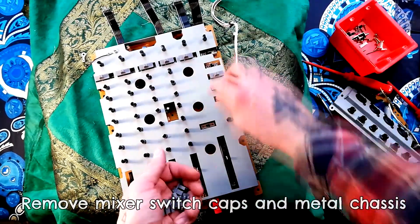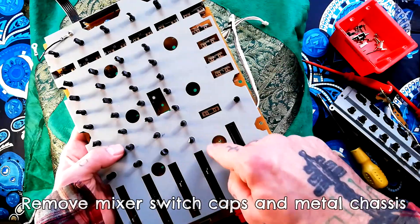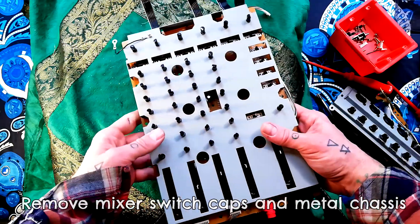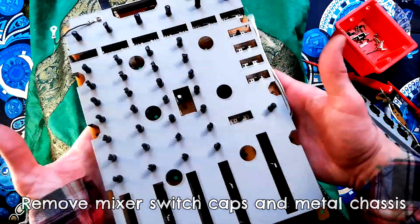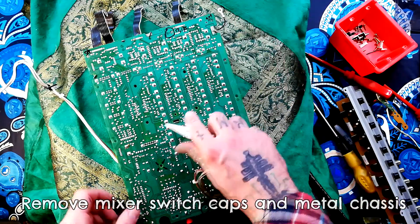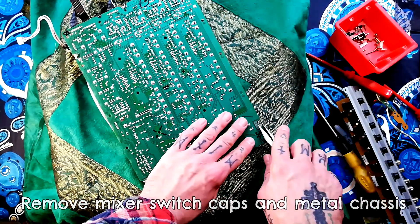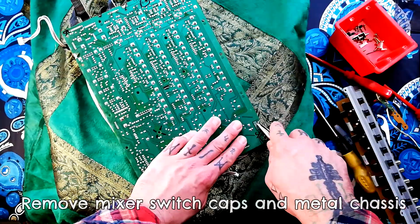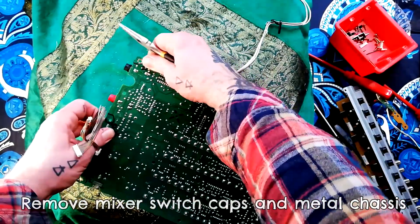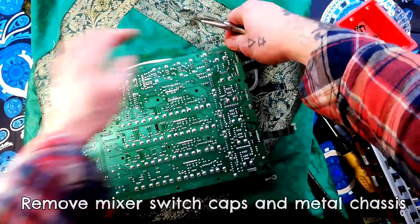At this stage you could pull off these switch caps so they can be cleaned — they get dirt around the edges, and they're all identical. To actually get at the pots for cleaning and to remove them if you're doing that level of soldering and repair, this heavy metal plate needs to be removed. There are hinged teeth holding the pots in place — one in the middle, though that one doesn't seem to hold tightly. The ones attaching to ground just slide out of the way. Then keep working around all the pins until the plate comes away.